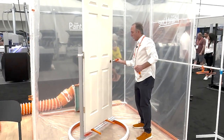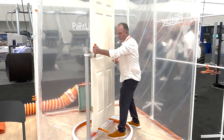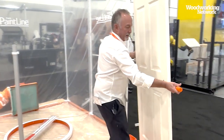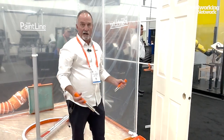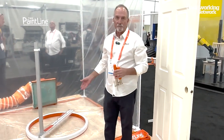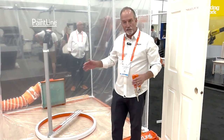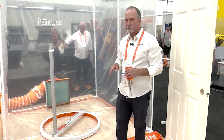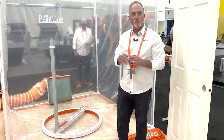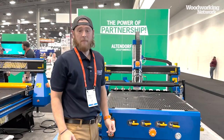The challenge then becomes removing a wet door off the turntable without touching it. We enter the doorknob hole with a tool, go to the V-clip, slide it back away from the post, and turn it — now we've got complete control over the door to go place it and nest it with other doors. It works with both hollow core and solid doors. All of this breaks down into two carry bags for easy transport to a job site or storage. The standard offering is for 20 doors, with additional accessories available for 10 doors at a time, up to 100 doors.